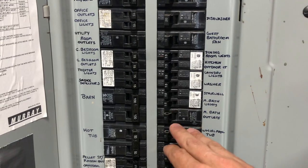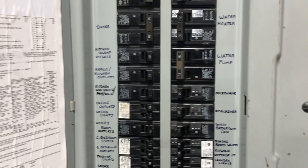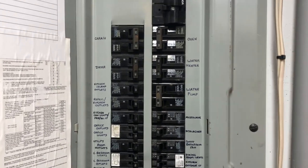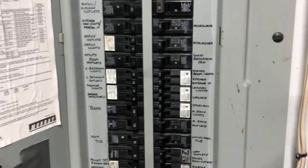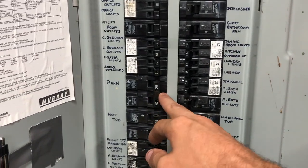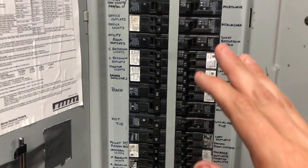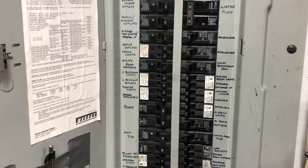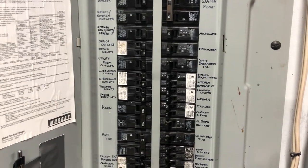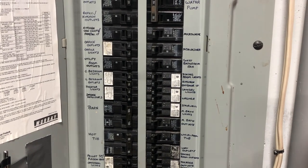As far as it usually goes, you will have outlets on a 20 amp and lights on a 15 in most cases. There might be some cases where it's a crapshoot. But you can definitely narrow down your choices by getting rid of your two poles and some of your big appliances, narrow it down, and find it with a simple light and maybe having somebody yell or you doing the legwork. I hope this helps.